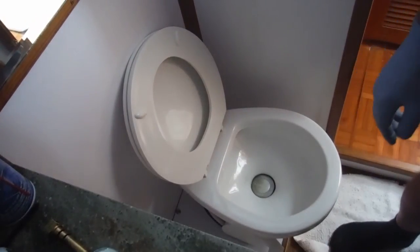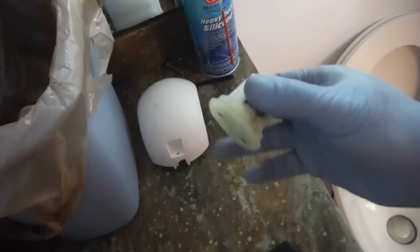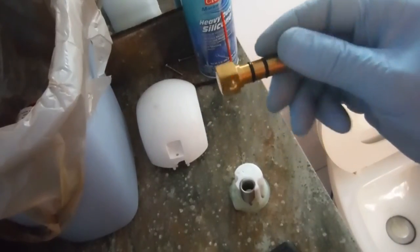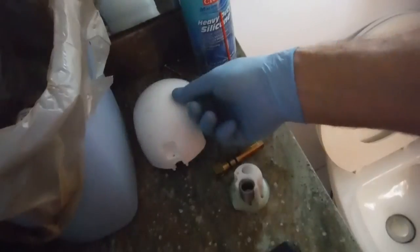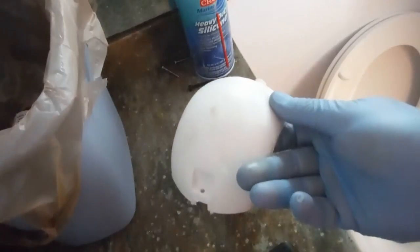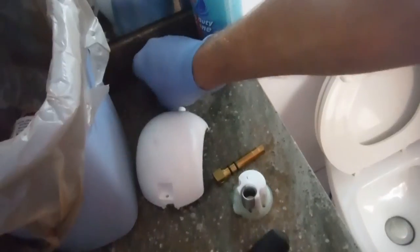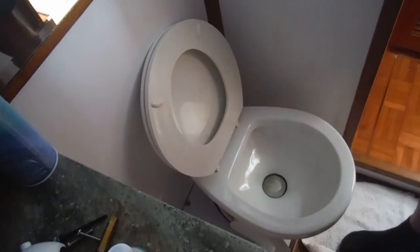We're back to the half ball cock kit. These are the parts it basically consists of: a spring cartridge, a shaft half ball shaft with o-rings — this is a metal one because you'll find a lot of the old heads with plastic ones and they break. Then the new half ball — you can see why they call it a half ball — which rotates the flush. I always spray everything down with 100% silicone spray. Then new hardware. This is the bowl, so we're going to start with removing the china ball.